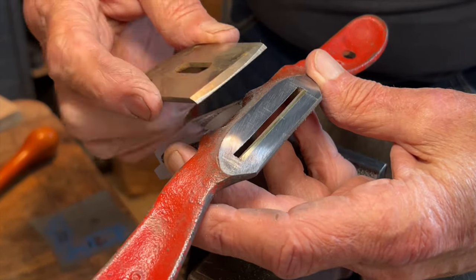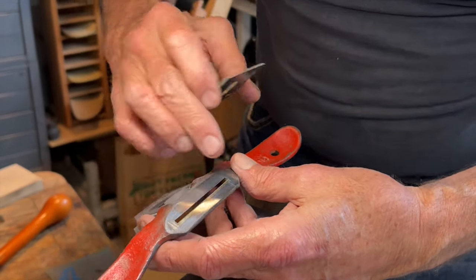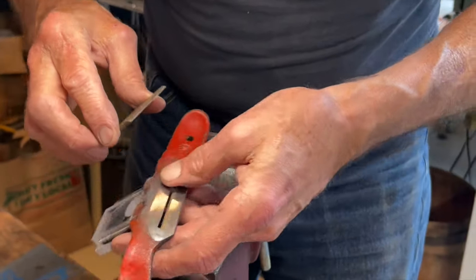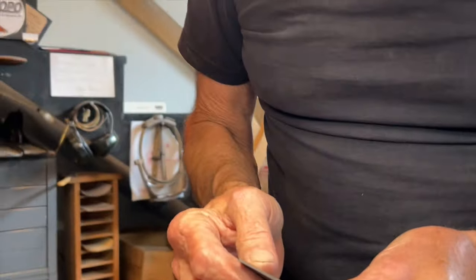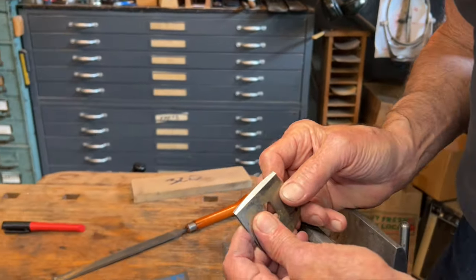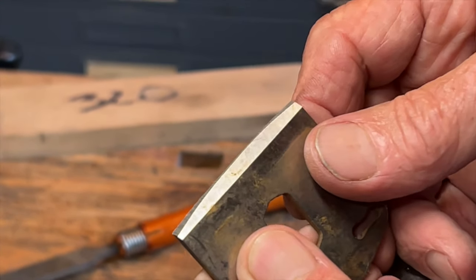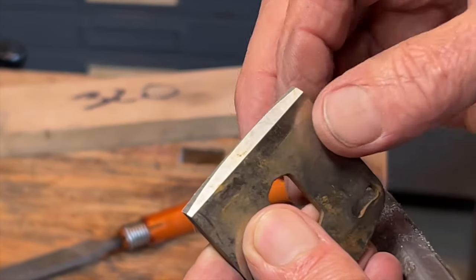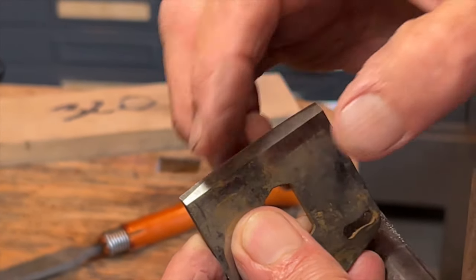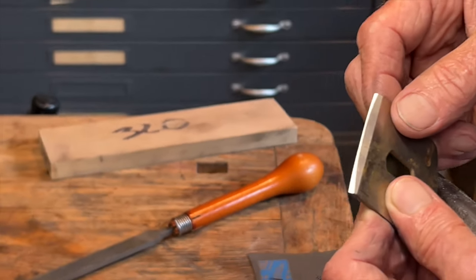Now, here's the blade that we had in there just before, when we were sanding this surface to a transverse curve, and you can see that we've curved the blade as well. It doesn't look perfectly symmetrical. It looks like a little bit more came off this side than that side. That isn't really a big problem. But we're gonna mark this up with the black magic marker and go to the grinder and try and get a nice cut on the bench grinder with this.